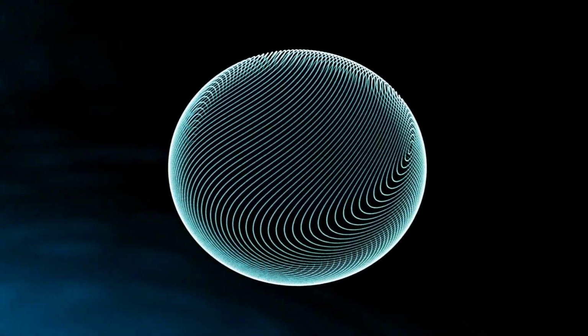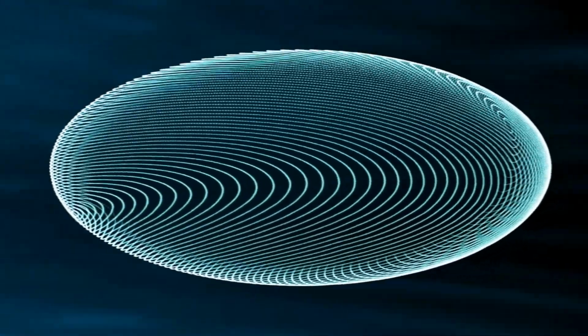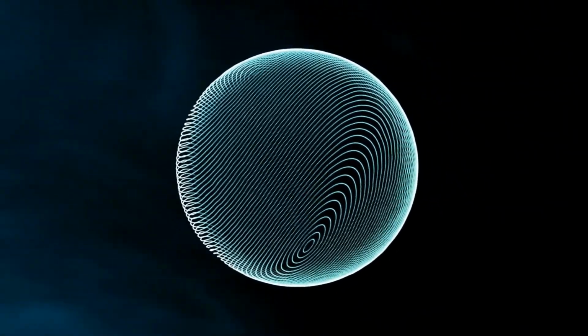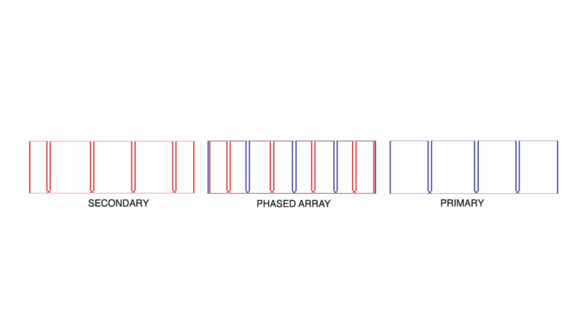This is because the loop is basically a sphere with the top and bottom flattening as the width increases. Conversely, height decreases as the width is reduced past the point that the sphere is round. If the segments are smaller than 3 or 4 feet, they will not extend high enough to create a usable loop field.